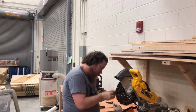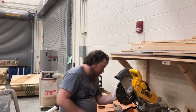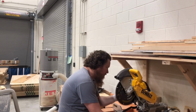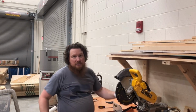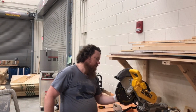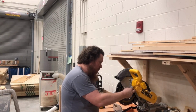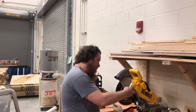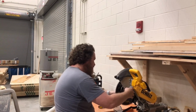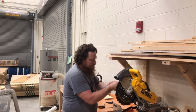Blade back on. And now we can tighten our bolt back down. Again, it's counter-threaded, so it's counterintuitive to which way you want to spin it. So, finger tight. And then the rest of the way with the box wrench. That's good. Tighten our screws back down.